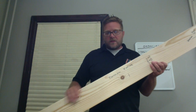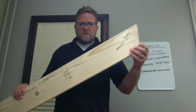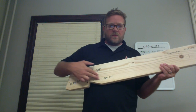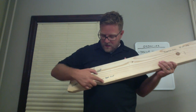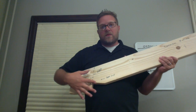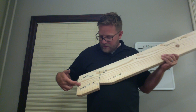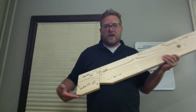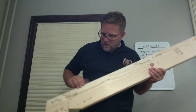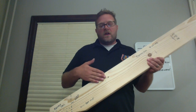So we're going to start with this one first. This is a common rafter. The part up here is our ridge cut — this is the part at the top of the roof. Here is our bird's mouth. This is our heel and this is our seat cut. We're a minimum of an inch and a half here so it grabs the top plate, and a minimum of a three-and-a-half-inch seat so it sits completely on the top plate. Here is our rafter tail, our plumb cut, and our soffit cut. The dimension from the ridge to the building line, also called the HAP, is what we call our line length of our rafter.